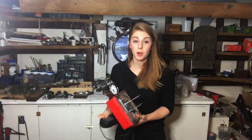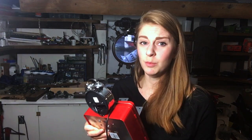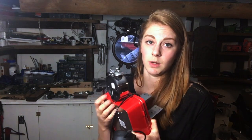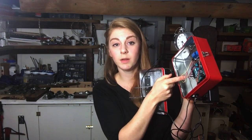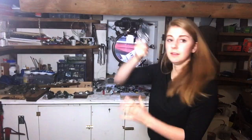So what I did was I picked apart this alarm clock. Clocks are not made for picking apart — there are so many small parts they just flew all over the place, and now the clock isn't working anymore, but it did work. Basically what I saw was that whenever the alarm went off, it had this little switch that grounded another connection. So one wire goes to ground, and then I have one that goes to the little pad that gets grounded whenever the alarm goes off, and I'm reading that signal with an Arduino Uno to control a relay that starts the motor.